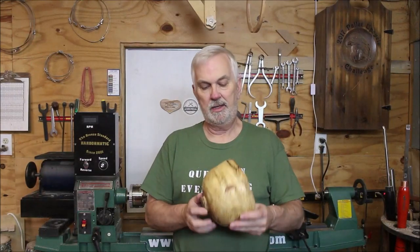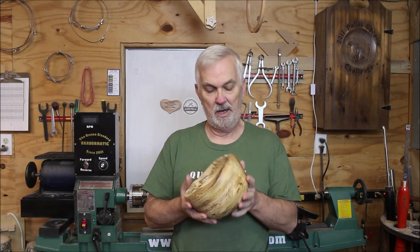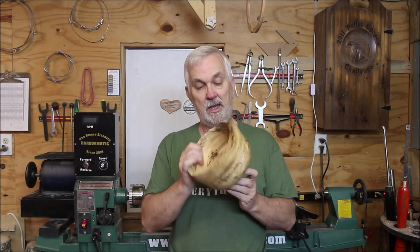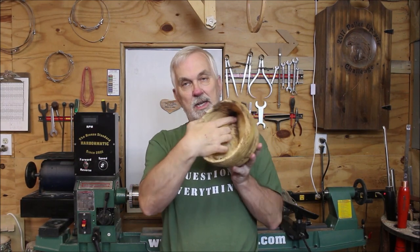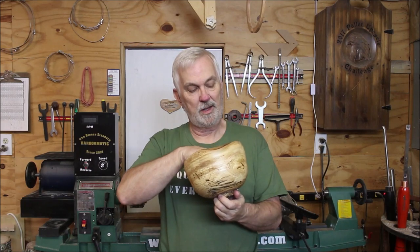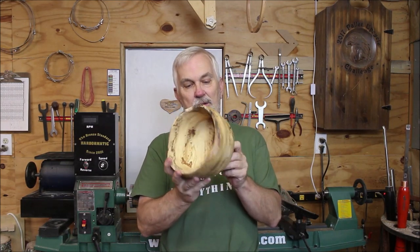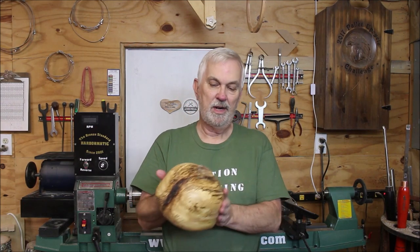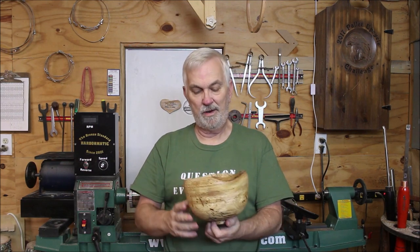Okay, I'm going to have to cut this video a little bit short here. I wasn't able to finish this just quite yet because when I started getting down to the bottom, I've still got a ways to go, but I started running into all this punky stuff right here. So I'm going to have to put some epoxy or something in there and get that to harden up before I finish taking the bottom all down. And I think I'm going to go ahead and refinish this whole thing, resand it, and refinish.